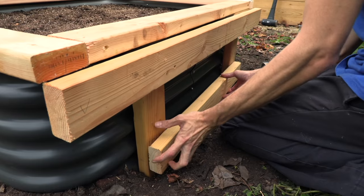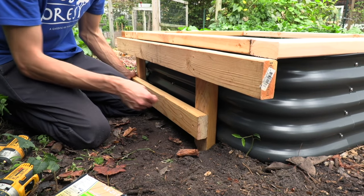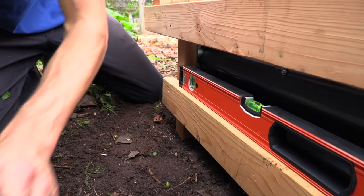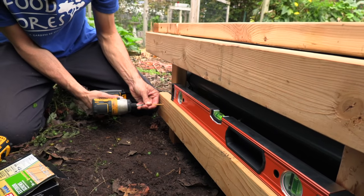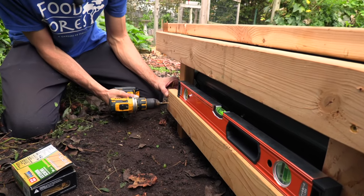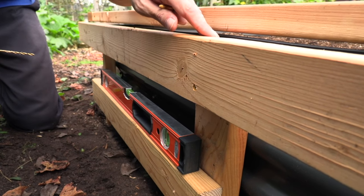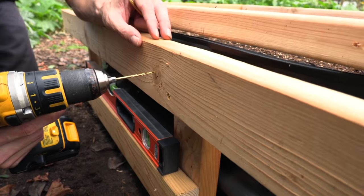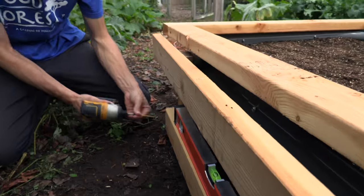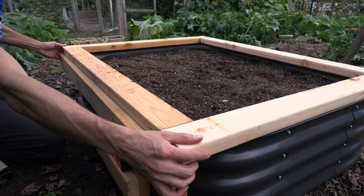Let's get this 30-inch piece down at the bottom. I'll put a level up here to make sure it's level — not that it has to be, but just so it looks nicer. I'm just using a regular drill bit for this, not a countersink bit because it doesn't really matter. I'll put two screws in each staggered. For the top brace I'll do the same thing — two screws. Now we've got this back brace built where we're going to be attaching everything.